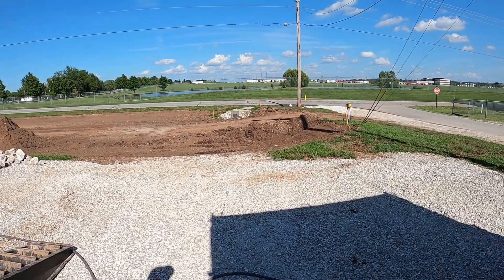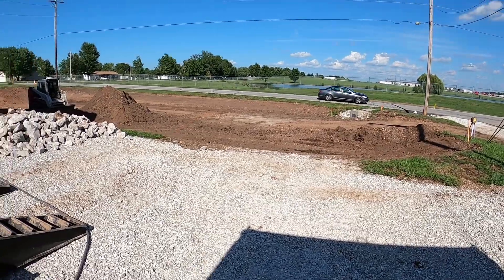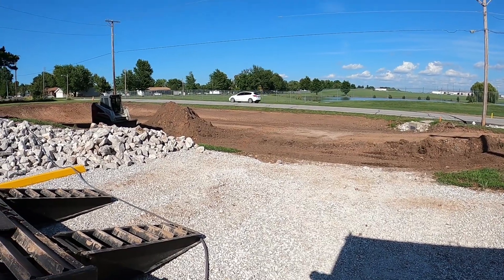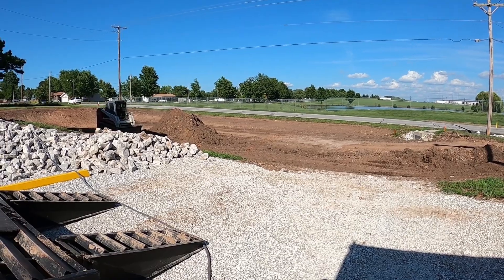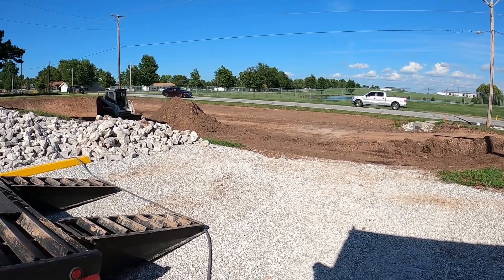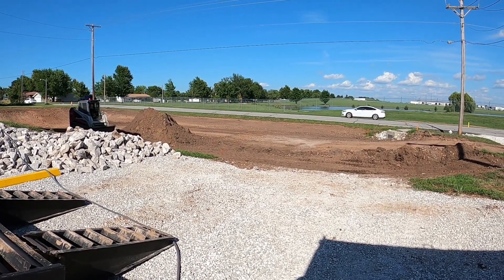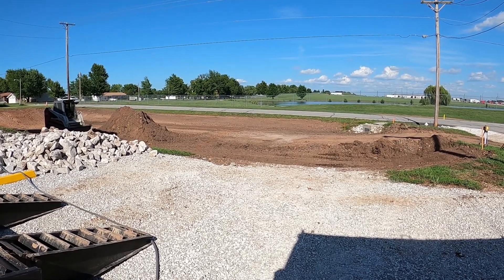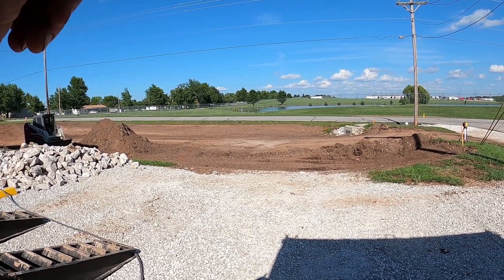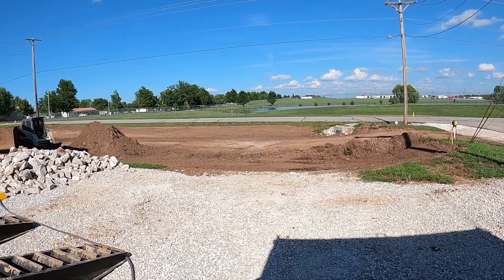Before it was just that little divot and then part of that corner, but now they want to use the whole top of that berm. I've got to bring that up — that's why I didn't want to haul out all this dirt. What I have left here I'm going to push up and kind of shape on there. We'll take these shots and go over that, and then I'll get in the loader. I'm going to take that pile and start dumping up top and then start cutting this, just piling up here trying to get everything done with the loader today. I've got a hydraulic leak on the pilot pump — I think it got an O-ring. It was just a drip — I noticed it earlier today, it was leaking a little bit on the ground. I'm going to try to just finish the day out and get some of this stuff moved.